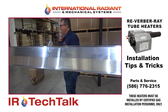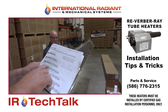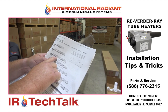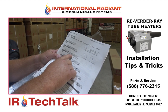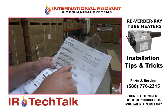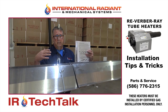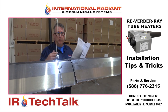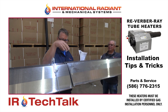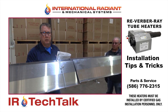Refer to the manual — around page 23 — for where to secure the reflectors. As an example, on a 40-foot model you would secure between the first and second reflector with sheet metal screws, but leave an expansion joint between the second and third reflector, then begin securing again between the third and fourth. Securing reflectors properly is very important for keeping everything intact, especially in windy applications. With hangers in the right spots and reflectors secured in the proper spots, you'll have a nice long-lasting, proper, clean, and safe installation.